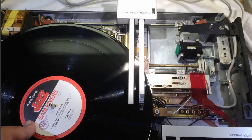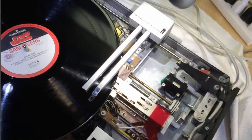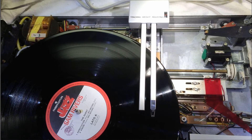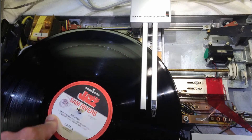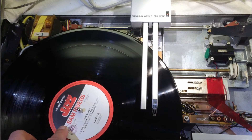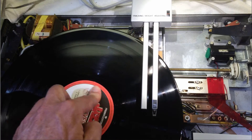A great trick here is to use that potentiometer and change the gain a little bit for fine tuning. What I'm doing here is simply increasing the intensity a little bit and then trying again. After increasing the intensity the servo comes on a little bit earlier because there is a little bit more light going through the aperture. After four turns it started moving — that's pretty good. One more test and it's consistent. We're pretty much done.